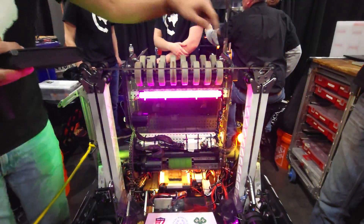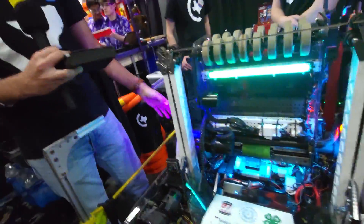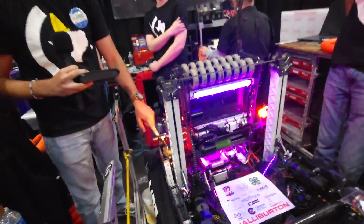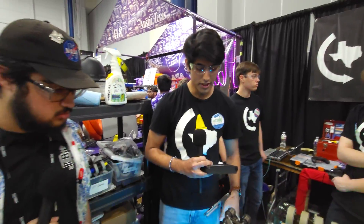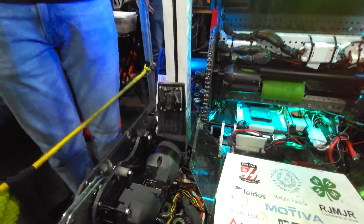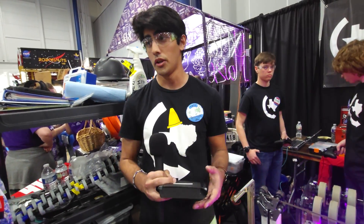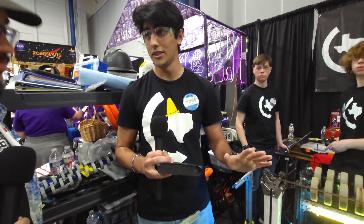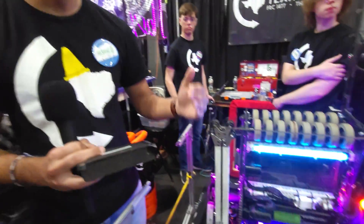Right now in the robot we're running two cameras. They're basically like Arducams but a little bit more durable, which is really helpful because the robot can get banged around. These cameras are both always looking for AprilTags on the field and they help us with localization in auto and also with our auto-align system during teleop. This camera in the front is for finding notes in auto, especially at the midline. One of the first things our programming team did when the season started was get a bunch of notes and start training a model using YOLO V8. That is designed to find the notes and also potentially identify other robots on the field — so if we're going to the center line and we see another robot coming, we can try and dodge them.